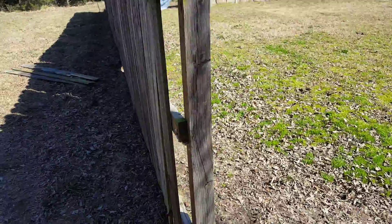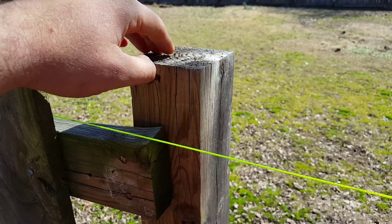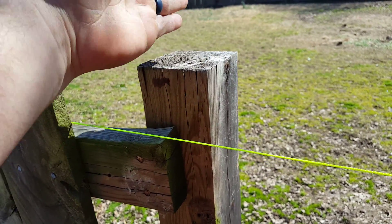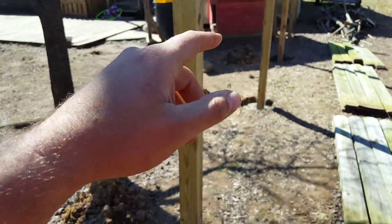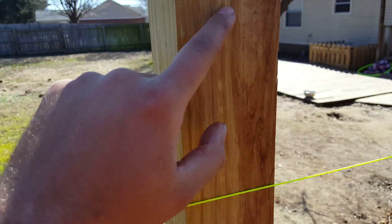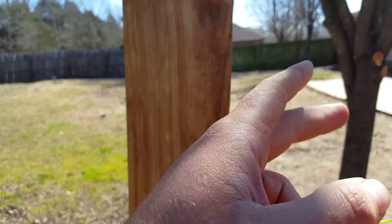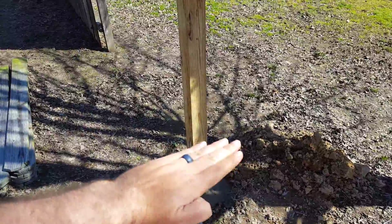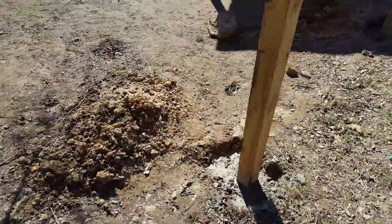The way this is done just really isn't right. I'm going to put a 2x4 up here on half of this, do the same down here — cut this, put a 2x4 in half, and then go to the next half and start the next 2x4. Then we'll put one 2x4 down here at the bottom, like this, from here to the other side.